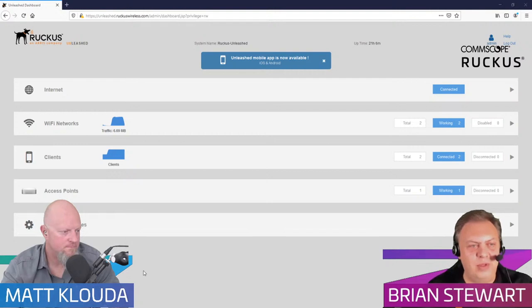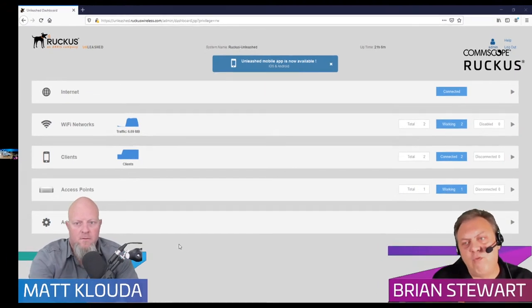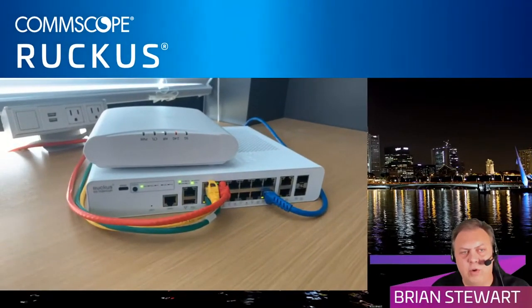So, you know, let me know if that's kind of what you were looking for there, because the Ethernet interfaces on there, we can use one or both of those Ethernet interfaces. Just one of them will take the PoE power. So if you've got a Ruckus AP with two physical Ethernet interfaces, one of them will be the PoE to power the unit itself, but you can use both of those for data transmission, or you can chain that to another AP back behind it or to other devices behind it as well. So let me know if one of those two answers the question for you.